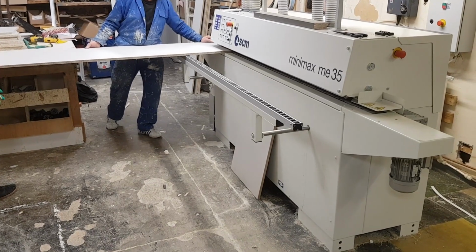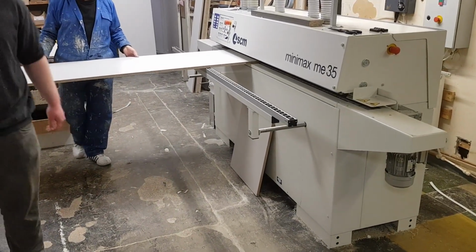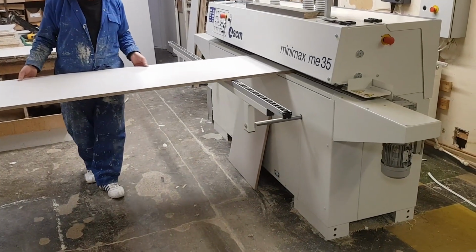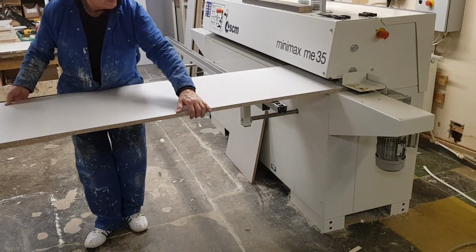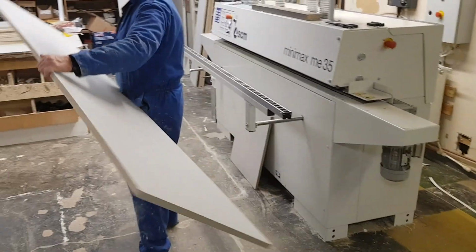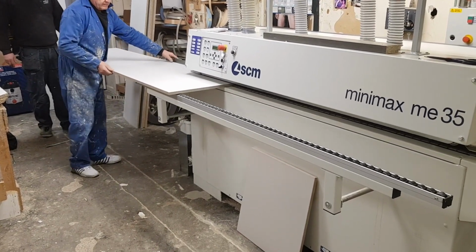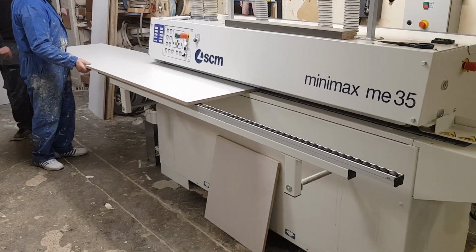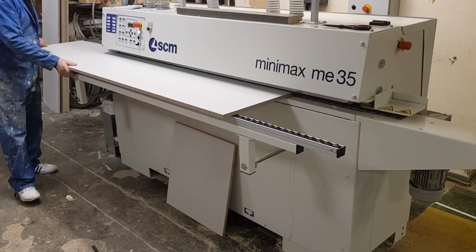Kit for glue pot rapid substitution, which includes the rapid locking and unlocking device and the double thermoregulation system to manage 2 different working temperatures for the polyurethane glue. Spare glue pot is available as option. Glue scraper unit for a better finish without compromise and a special scoring unit for glue's execution on the upper side of the panel.